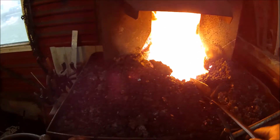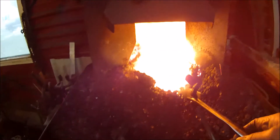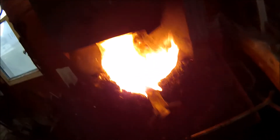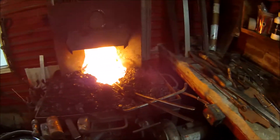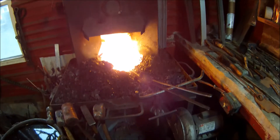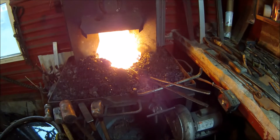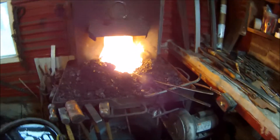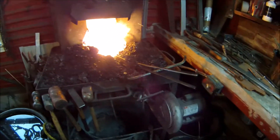This is starting to come up to temperature. The first weld on each billet is the most important — don't rush your weld. It's looking good but not ready yet. Keeping it right in the heart of the fire — this is a nice reduced flame, which is optimal for forge welding because oxygen is contaminating in a forge weld. I'm going to add a little flux here in just a second to make sure it's ready, and then we'll go from there.